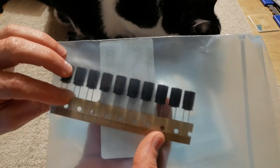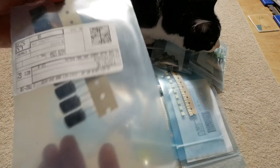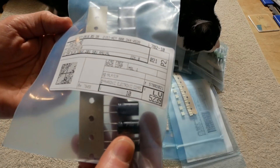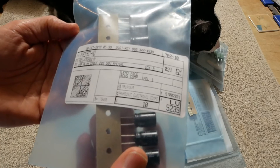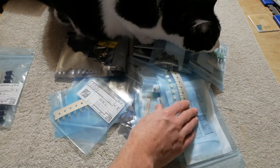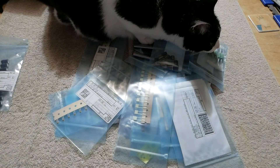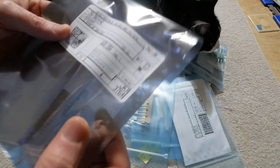The first parts here are just some capacitors. These are the onboard supply bypass — 220 microfarads should do the job. Just grabbed some stuff at random. I also bought some NE5534s, which are single op amps in a chip.